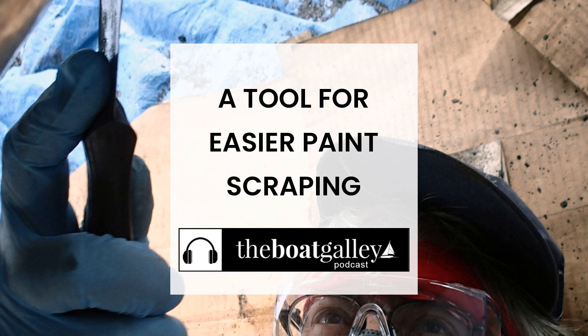The thing about a catamaran versus a monohull is that the cat has a lot of bottom area that's parallel to the ground. I laid on my back for weeks on end scraping away while Dave followed behind wet sanding it down to the gel coat. We tried several different scrapers and kept returning to a simple putty knife as doing the best job without gouging up the gel coat.